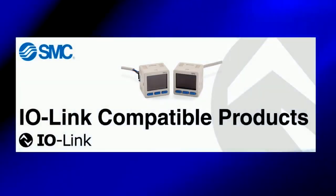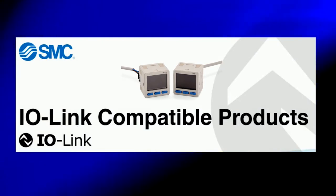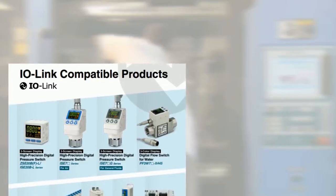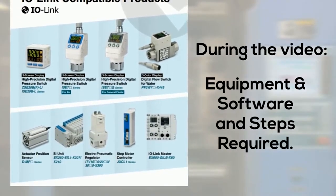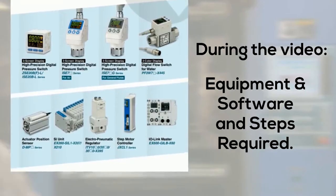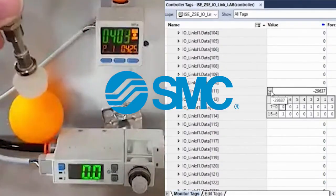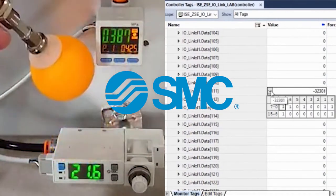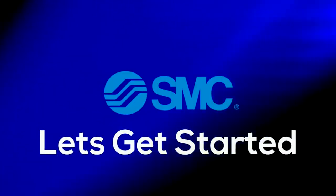In this video, we will set up the EtherNet module for the IO-Link master, enabling the ISE20, ZSE20, and other IO-Link devices. During the video, we will show you the equipment and software you will need and show you step-by-step how to complete it. In the end, we will verify application pressure monitoring activity through IO-Link control from ISE20 and ZSE20 port process data. Let's get started.